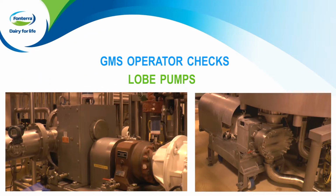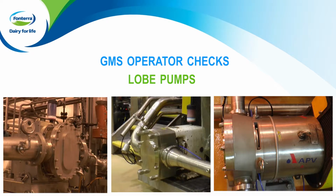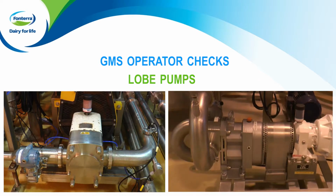Lobe pumps are designed to pump product from one location to another. They are usually sized to accommodate product type, flow and volume. One of the benefits of this type of pump is they have a constant flow rate, even with a change of inlet pressure.